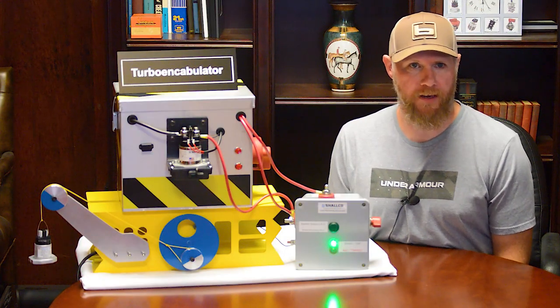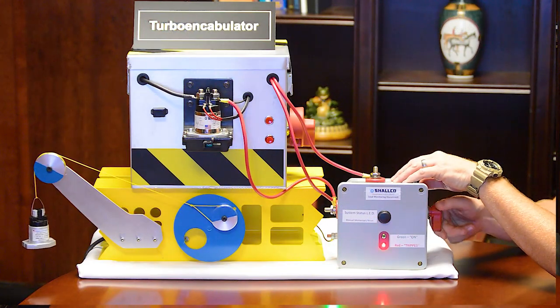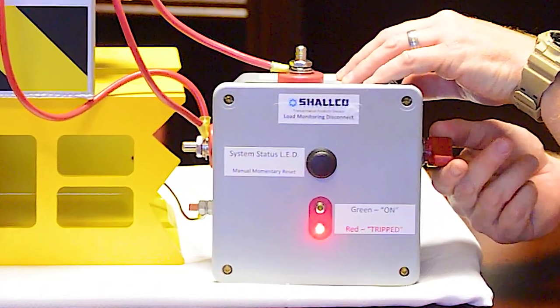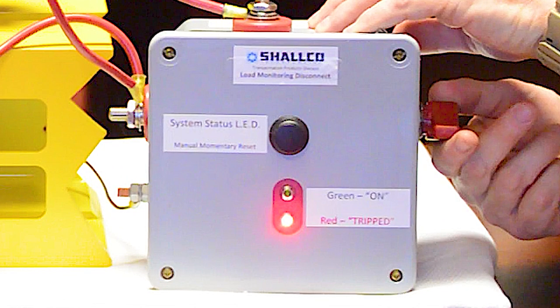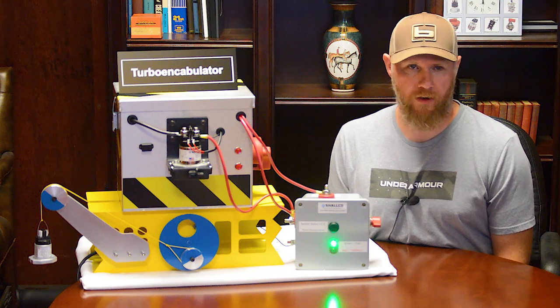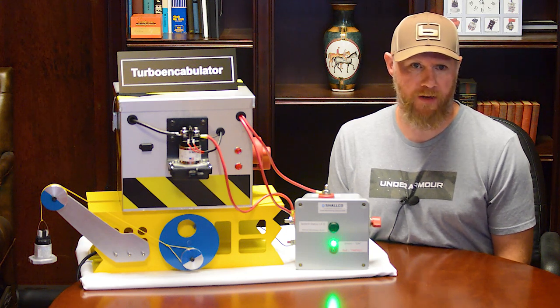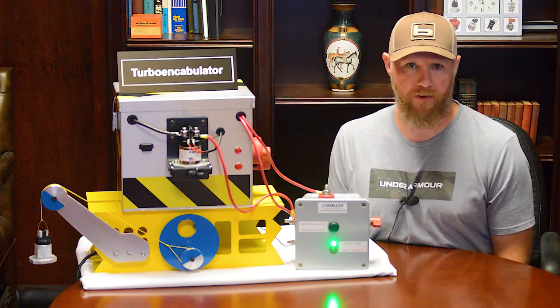Also notice that in the beginning stages of normal operation, when rotated, the master disconnect switch supplied power to the real-time monitoring circuit inside the box. The red LED illuminated to show that the system is working and has disconnected all loads. As a precaution, the system automatically disconnects all loads despite the current load conditions — it assumes the worst and prevents the system from reconnecting despite any operator assumptions.